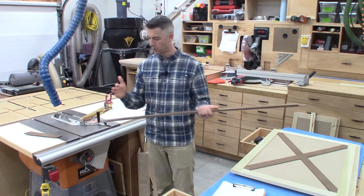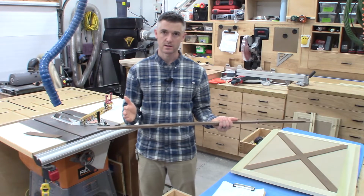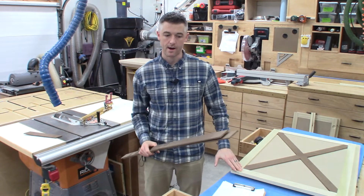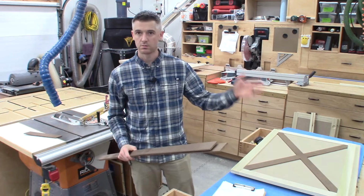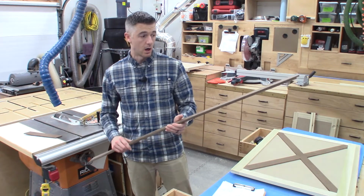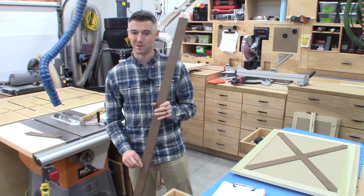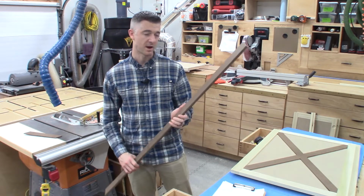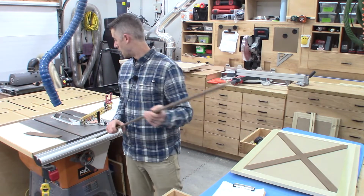And once I know basically one of the angles of my cuts, I essentially know the rest of them. Since my doors are square, basically everything is an angle, 90 minus an angle, or 90 minus 2 times that angle. But I'm still using the reference lines to double check that, because math sometimes can be hard, and sometimes our brains are stupid. So that's what I'm up to now.